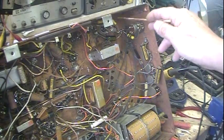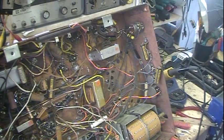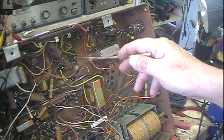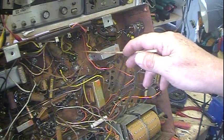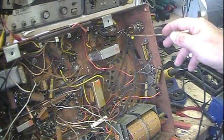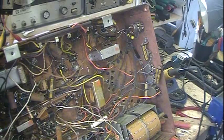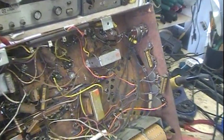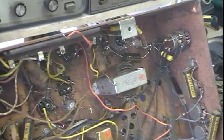I've started up in this circuit, in this area here. I've been getting everything kind of bolted back down where we went through the IF — that was in a previous video — and the tuner. And now we're starting up in here. I've got the cans reinstalled after re-stuffing them, and I've got to get them hooked up and replace capacitors and out-of-tolerance resistors.